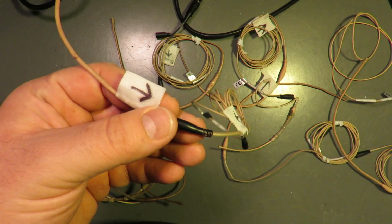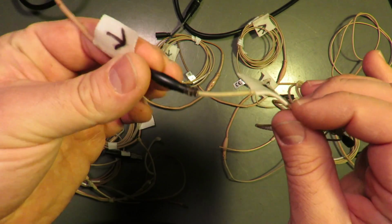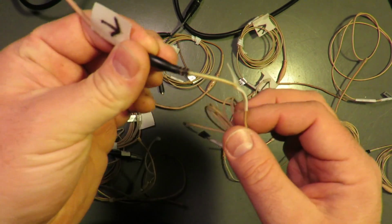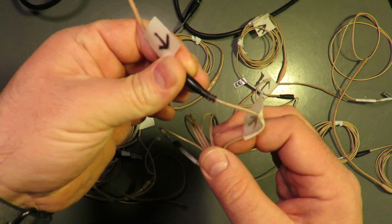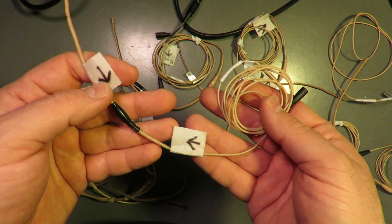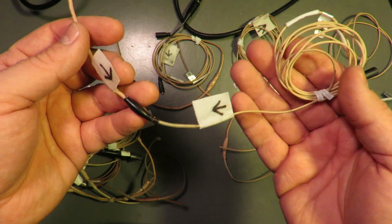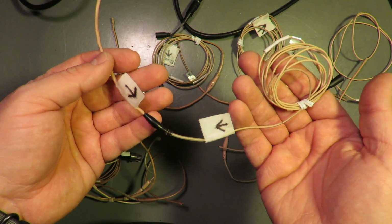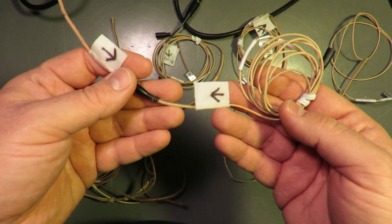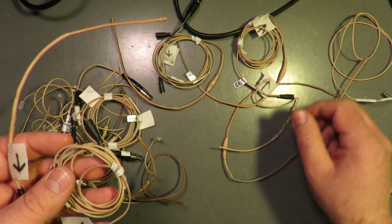And our problem was, when the actors moved and they would turn their head, it would pop. And that burns the mic. It's still passing audio, but anytime it moves, you get a pop, and that means the mic is dead. You can't send that on stage. So we started getting quite a few of this happening.